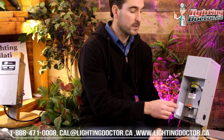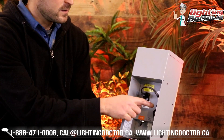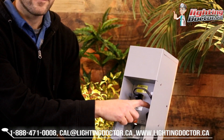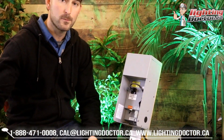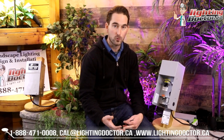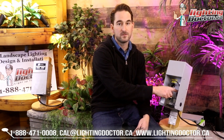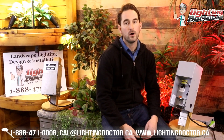The other thing I like about these bigger ones is that the voltage taps on these are 15 volts. So instead of just starting at 12 volts, you're actually starting at 15 volts. That means you can lose even more voltage drop along the line and still have your lights work at 100% efficiency. Most LED bulbs out there run very efficiently anywhere from 9 to 15 volts, so you can lose up to 6 volts down the line and still have those lights at the end working properly.